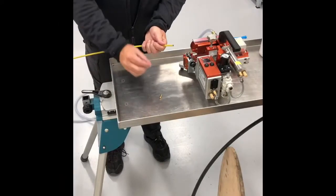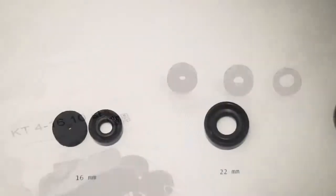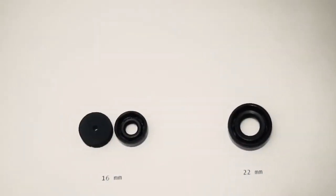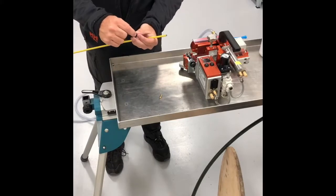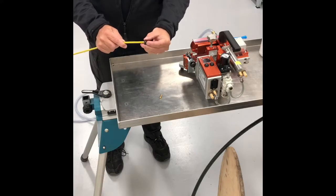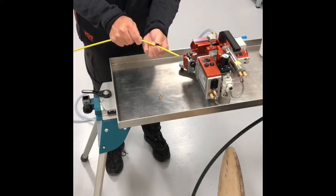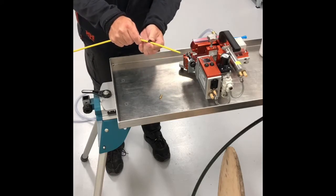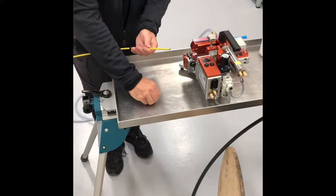To prevent air from going backwards, you need to install a cable seal on the cable. We have two versions: divisible and standard. The standard one must have the open face towards the air so that the cable and the seal will be really airtight. It's important that the cable seal is really tight on the cable. If it's too loose, it will leak air backwards.